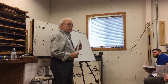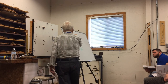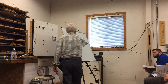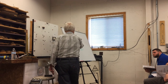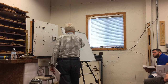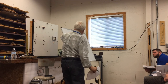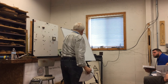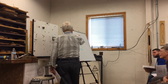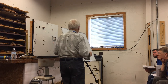So bearing in mind that a diode is a one-way valve, we use it for steering here. At any one point in time, this terminal will be plus, so we want it to go there. So we put a diode there. It goes through here. And of course, it wants to get to minus. It needs to get over to this one. So we put another diode here. So now for half of the cycle, going up, we have positive current going through a diode, through whatever it is, back up to the negative terminal, then through a diode, then back to the power supply.